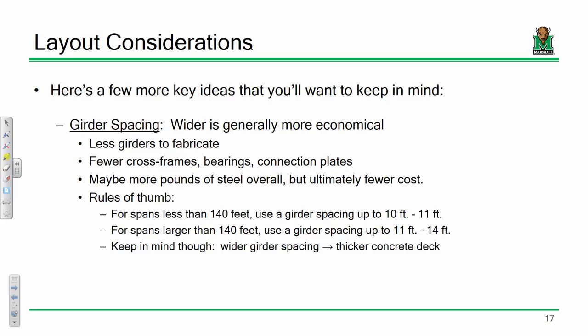Okay. Again, let's look at it like this. It goes back to fundamental assumptions in concrete or steel. What load must all beams be able to withstand? Self-weight. Now, at the beginning of a design problem, do you know what the self-weight is? No, because you don't have the beam, right? So what do you do? You assume a weight. Does it matter what that assumption is?